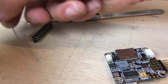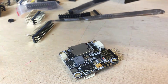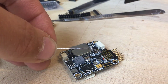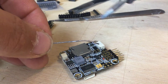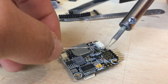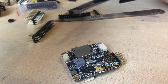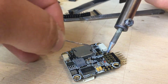A little tip: I'm right-handed so I've got the soldering iron in my right hand and the solder in my left hand. I start at the front pin and then work up a row, then come back down and work up a row again. The reason I do that is because the heating element warms up the next pin as I go, making it a bit easier.